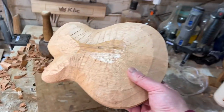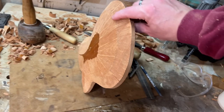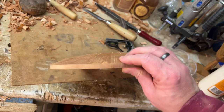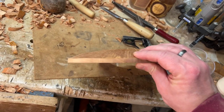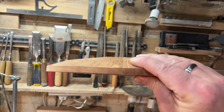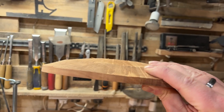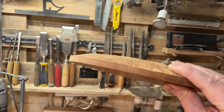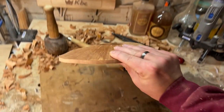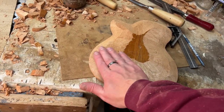Once we've gone all the way around, we get something a bit like that. We could keep halving all the way through, getting less and less taken off each time, but already with just those two cuts you can see we've got a relatively decent arc. We've got flat in the middle, first cut, second cut, edge. It's not going to take much to just start eyeballing it with rasps and files to start smoothing that off all the way over.